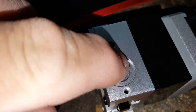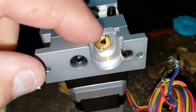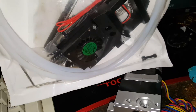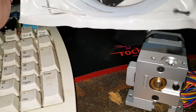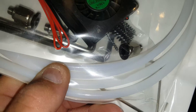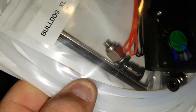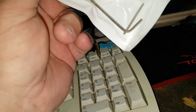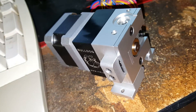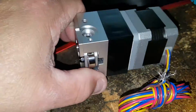As you can see from the top, it's threaded on both ends. It does have the J-head mount too. It comes with everything to do it — direct drive or Bowden. You can take a flathead and take that out. The fan and stuff is included as a gift, as they say — they don't warranty the fan. The fan is for the hotend. It comes with tools, wire, and cleaning brushes. It also comes with 3mm and 1.75mm tubes and connectors for Bowden. With shipping, it was $150 from Maker Farm. It's a nice extruder. I'm going to mount it today on my Ordbot.